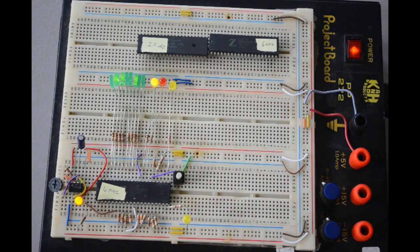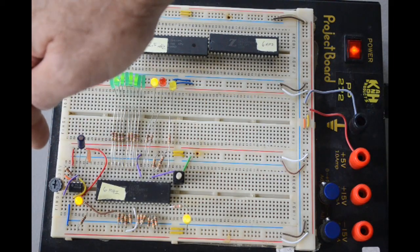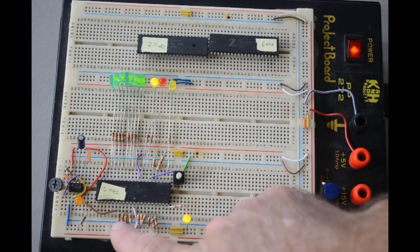These are Z80s that I have salvaged from old electronic equipment on the way to getting rendered down for its gold. And I built this little testing jig right here to test them to see if they work so that maybe I can reuse them. It's a pretty simple setup. I've got a 555 timer chip over here that's putting out a square wave. Right now I've got the frequency really, really low, and it's feeding into the clock input on the Z80 chip.